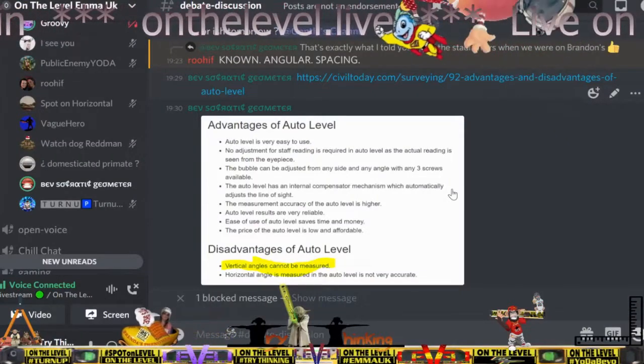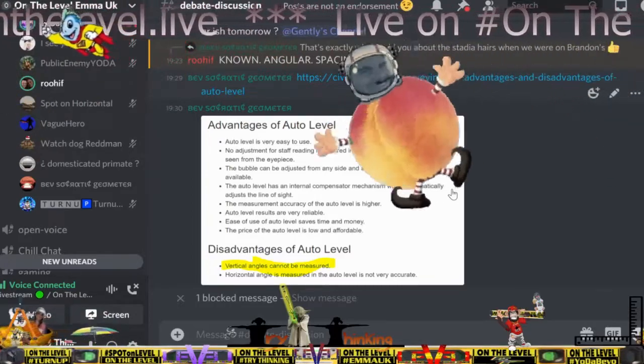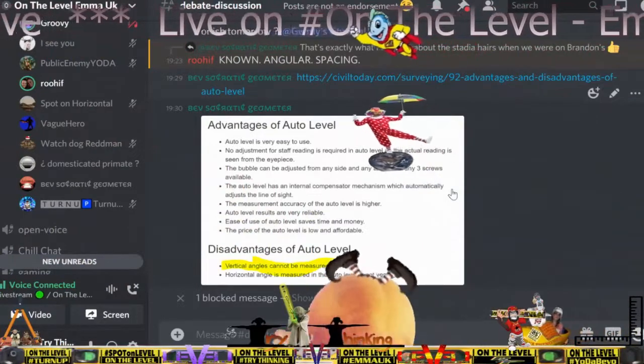Right. Well, now, what we do, because of the stadia hairs and the function that they are within the thing, we can, because we know the size of the object and the amount of compression, work out a distance that is away from the device. What is the relationship between those 3 things? It's just a function of distance, right? Yeah, but there's a relationship between 3 variables, right? Actual size, angular size, and distance. If you have 2 of those, you can work out the third. Do you agree?